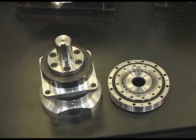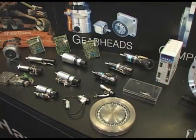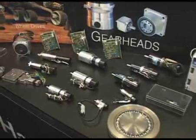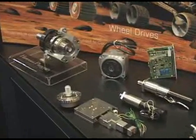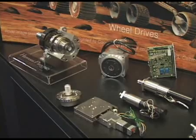Harmonic drives can either be purchased as a component set to be incorporated into a robot or similar automation equipment, or as shown here as gear heads, which can be attached to a servo motor. Harmonic drives are incorporated into a wide range of products including servo actuators, both brush type and brushless DC with integrated encoders. These are the most simple to use for your automation applications.